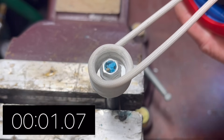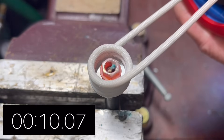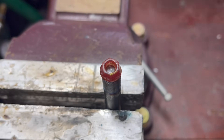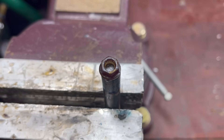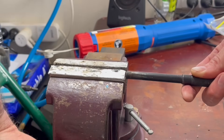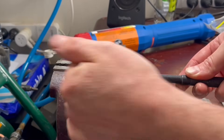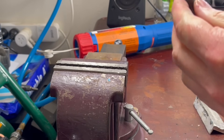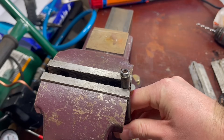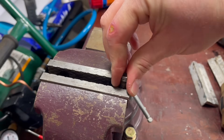Starting the timer now. The flux melted instantly on the bottom, the solder is starting to melt, it's going bright red, and there it is. Again that can't be more than 10 seconds. Now that it's cooled down, let's check how tough that joint is. I'm damaging the nut trying to break it free, and hitting it with a hammer - it's really not going anywhere. That has certainly done everything it needs to.